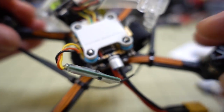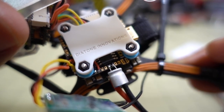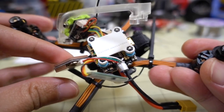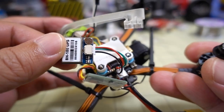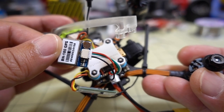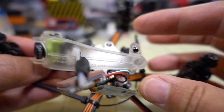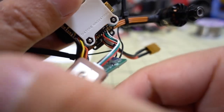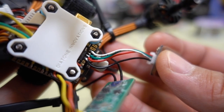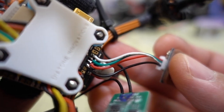I'm going to have to figure out how to solder this onto that capacitor — it could be a little tricky. It's very tiny, and I'll show you what that looks like after I'm done. Here's the soldering work. Here's the plug on this GPS, the BN-180. Your model might be different, so check your documentation. This is how the wiring looks on this particular flight controller. Again, check your documentation as the wiring might look different.